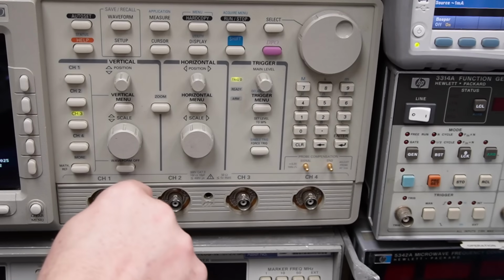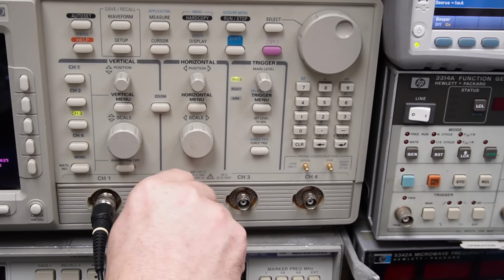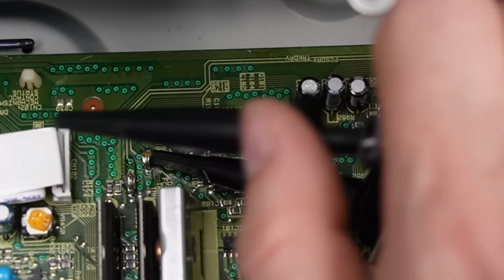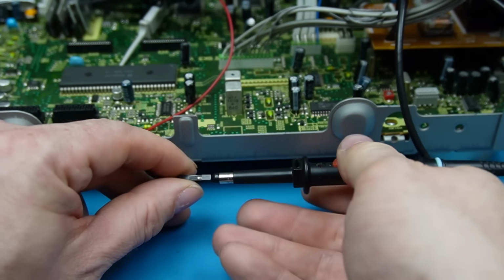So I'm going to want 3 probes, one for the sled output, one for the sled input from the microcontroller, and also for the lens tracking. So I can use my test loops. That's the sled, that's the tracking, and this is the sled command for the microcontroller.